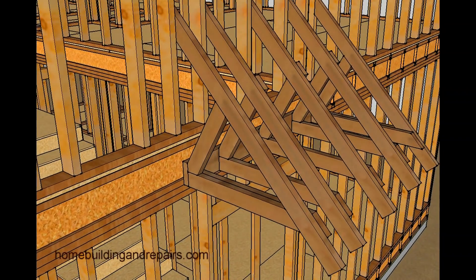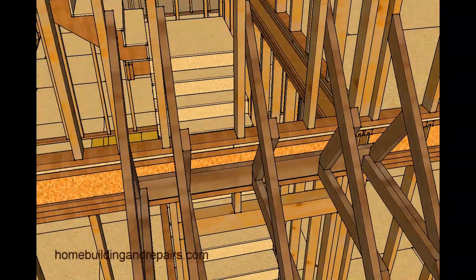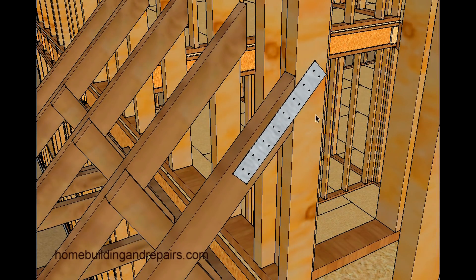Before I had a 2x4 ledger here, but I went ahead and made it a 2x6 because we're going to use it for our braces. If you have a situation like this, you can use a strap to nail the rafter to. Or you could nail a 2x4 onto the edge as a tie — something about 2 or 3 feet long instead of the strap.